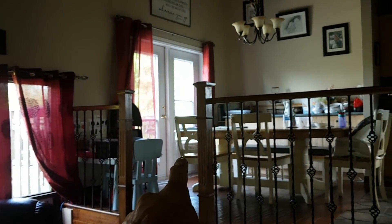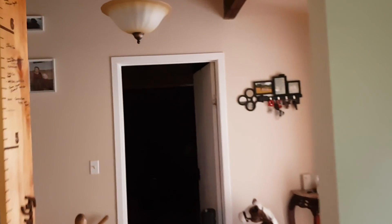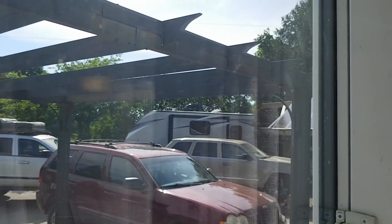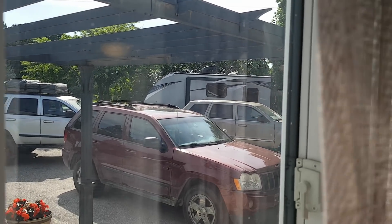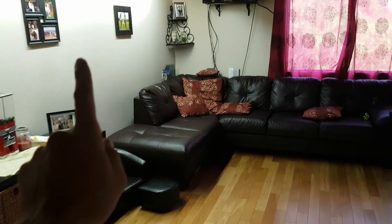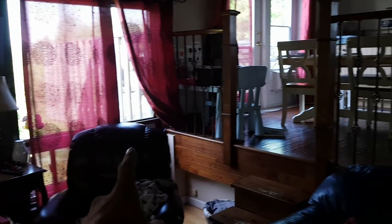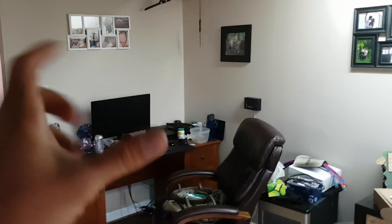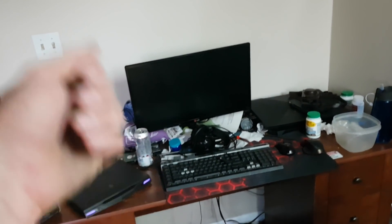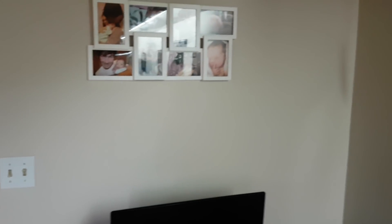I have this window air conditioner on, and my parents are here with their house trailer — they have a 15,000 BTU air conditioner — and we're all running off the 8,000 watt inverter. I already overloaded it once. What happened was I forgot to turn everything off, then they all locked rotor. The breaker popped, I flicked it, everything dimmed but nothing blew up. The breaker tripped again quickly but everything was good — it seems to have some good safeties.